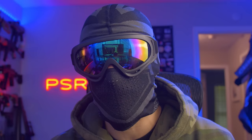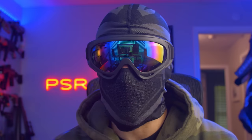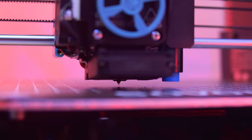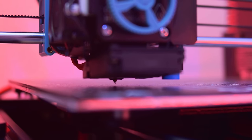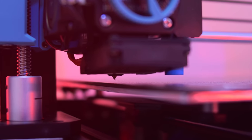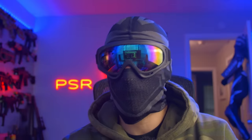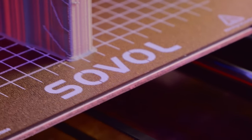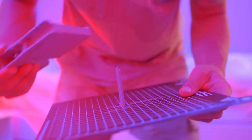The other really big feature is the capability this printer has to level itself. If you're a beginner who doesn't want to mess with leveling the bed, this thing does it for you. It uses 25 points and automatically compensates for any variation in the bed level using a probe, so you should be good to go. It's also got a PEI build plate — a really cool gold-colored plate that you just magnetically pull off, then crack the print off by bending the metal. It's a really easy way to remove prints, even if they're stuck.